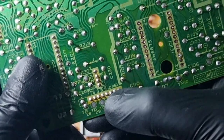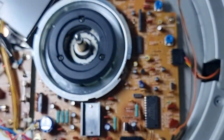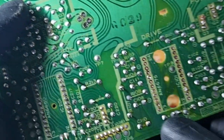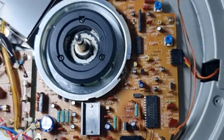It's not moving, it's firm. So if I try and move this, it's not moving, as you can see, really. There's minimal movement there, whereas this one here, when I move it, it's quite apparent. So if you've got dry solder points and cracked solder, these connections here will keep moving and don't touch properly, and it'll lead to problems. That's the long and the short of it.